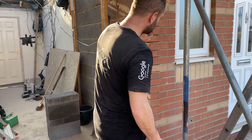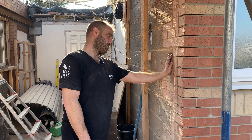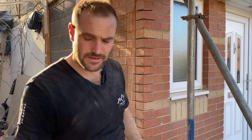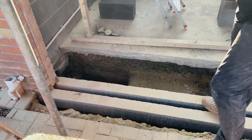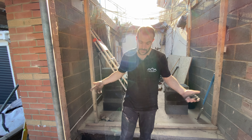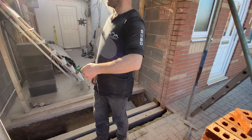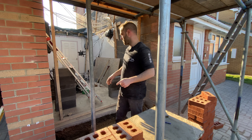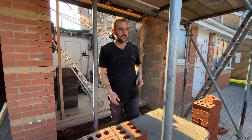We have been cutting out the toothings and cutting a vertical damp. We're going to have a 70mm cavity here — blockwork, insulated on the inside. I'm going to take these halves out now, very carefully, the same on this side here. We had to alter the concrete lintels — the bed on top of this lintel was going to be too big, which is fine if you're going to lay it and leave it, but we're not building straight off. So I lift the lintels up a bit, pack them up, point it up, and set the size for the cavity. Because I'm anxious about time, I'm going to get these out and just get the brickwork in, forget the blockwork for now — at least this window opening can be boarded off overnight.